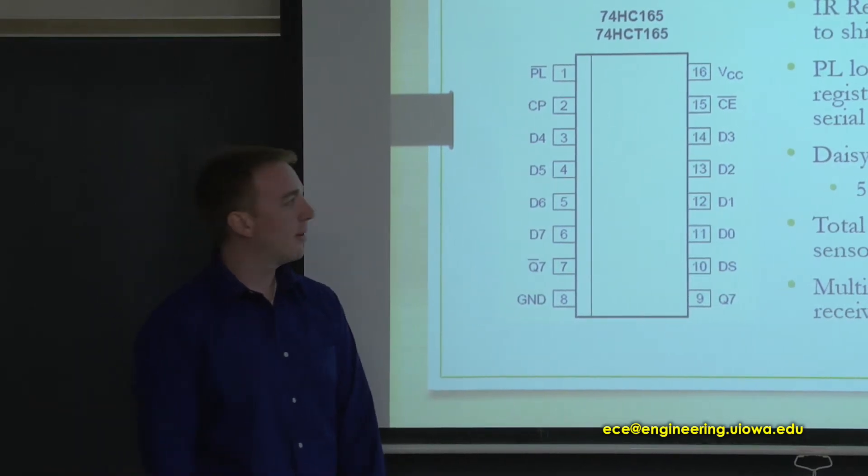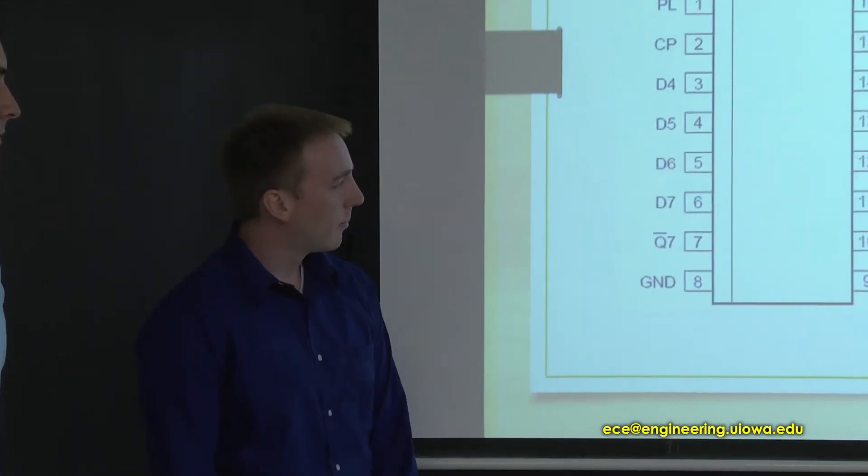To make the sensor mode more accurate, we take multiple samples when taking readings. Those samples are computed and it looks for about a 90% positive rate before turning on the sensor — so it takes 10 samples before turning on or off. That means instead of 36 clock cycles, you have 360 clock pulses just to determine whether the sensor is on or not. Our processor is fast enough that you won't see too much delay in the sensors.